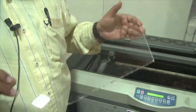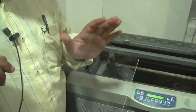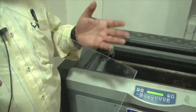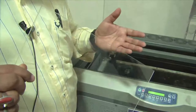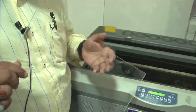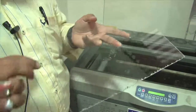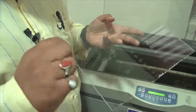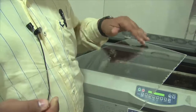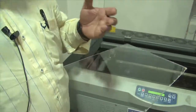So today, throughout this experiment, I'm going to take you through a series of steps where we are going to first etch the micro channel onto this system, and then with this etched micro channel, I'm going to modify the surfaces so that it can act as a micro mold. In another part of the experiment, we are going to use a soft polymeric material called polydimethyl siloxane, which is like an epoxy rubber which can be poured onto the top of a micro mold with some suitable release agent which you apply to the surface, and you are able to separate that later so that whatever channel-like features or other structures you have embedded onto this system, the negative of that is replicated or cast onto that liquid material.